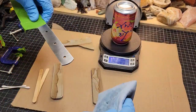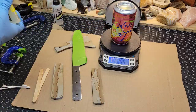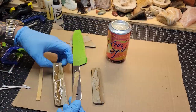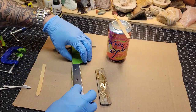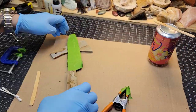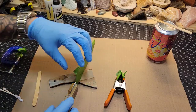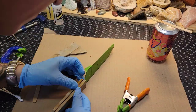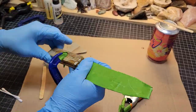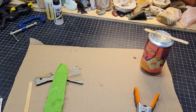This was frustrating to say the least. Epoxying these up, I should have done one side at a time. Instead I tried to do both sides and it kind of created a slippery sandwich effect. Typically you would have the pins that can align both sides and keep everything in place while you clamp it up — and obviously I didn't have that. I'm just using the epoxy. So it was a lot of fussing, a lot of back and forth trying to adjust it. Things would slip. Not recommended. There's got to be an easier way to do this.